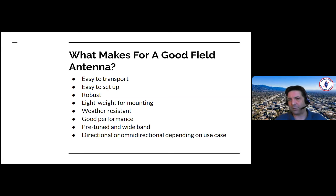A directional antenna may be the right thing for you. It should certainly be part of your kit and they're not super expensive either. Directional antennas with high gain have a big advantage. Because of antenna reciprocity, your higher gain is both on the send and the receive. So the other side doesn't have to change anything for you to enjoy the benefits of the higher gain.